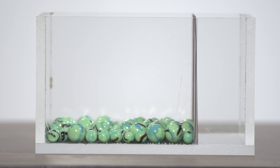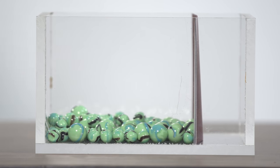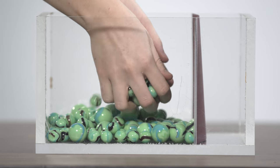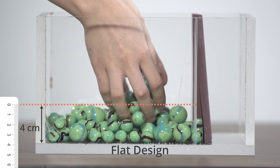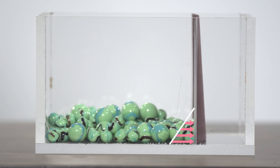As the depth of the model water increases, the cardstock bends, until the dam collapses, unable to resist the lateral loads. The marble depth that produced failure is 4 cm, and as you can see, failure started at the bottom. That should not be surprising, since the pressure is greatest there.